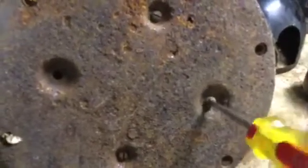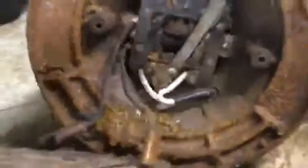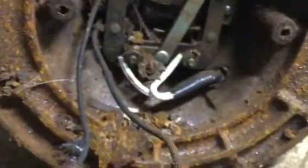These blocks — the reason why I have two of them is they're actually made for clamping mainspring barrels in a vise when winding phonograph mainsprings, like the Edison Triumph you've seen in my other videos. Screws were both loose. Oh, this is lovely — look at that. Originally these had 8-32 screws with square nuts there. I reused the old spaghetti tubing and soldered new wires onto the capacitor. That is disgusting.